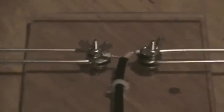The whole antenna's together. The center conductor goes to the top of it, shield goes to the bottom — pretty self-explanatory. We've got our feed line, our PL259 connector, and we're in business. All we need to do is slap a mounting bracket on there and we'll be able to throw it up. Please check out the other fellow's video that I got this idea from — he goes into way more detail.